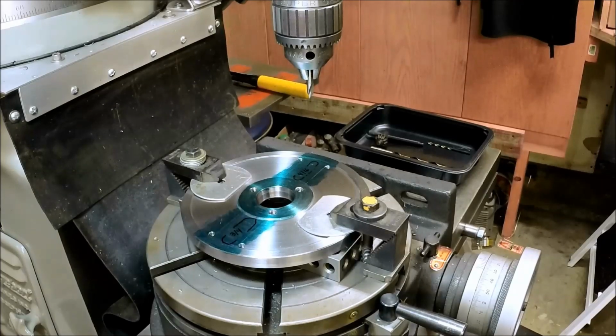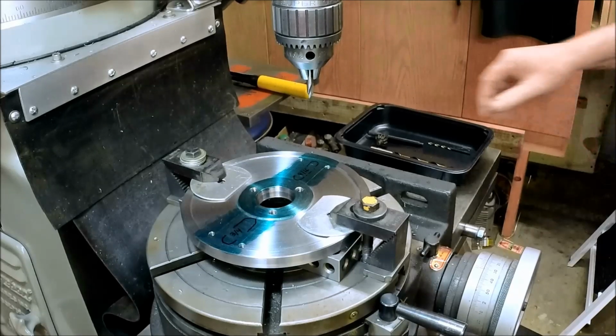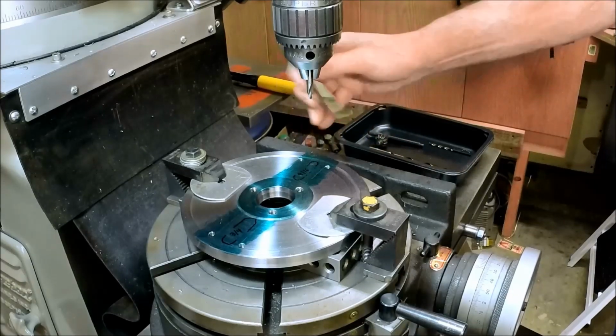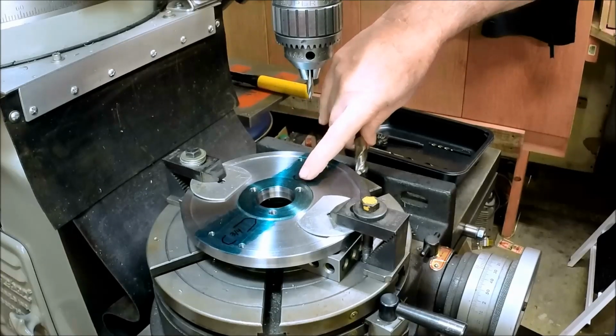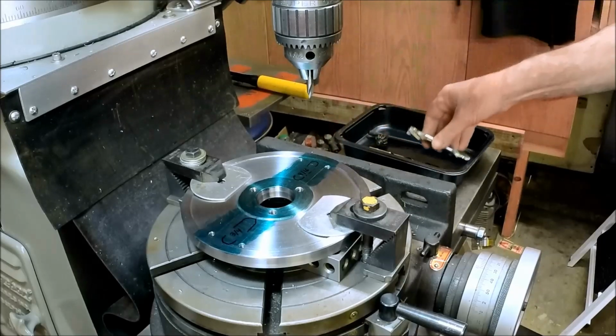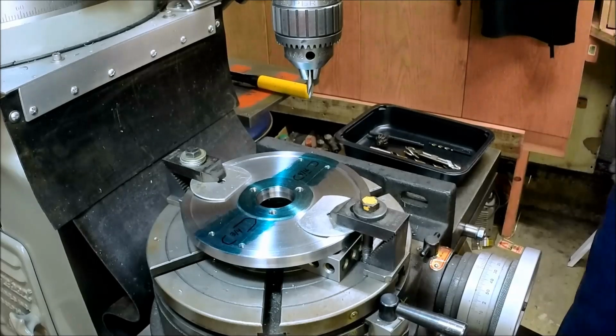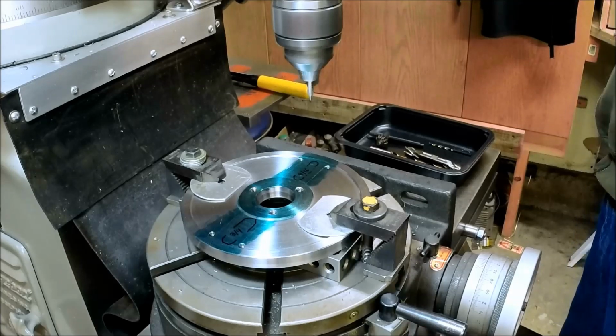We're going to drill a 1/2 inch hole at each end of our slot locations. I've got a layout line at each end. Probably can't see it on camera. And the idea is when we get toward our final dimension that we're going to leave this outer rim, and we're going to leave the inner hub. We'll get into the chamfer a little bit, but that's okay. Originally I was going to make one of these slots open all the way out, but I've tried all my lathe dogs, and so far it doesn't look like I need to do that. We can always come back later and do that if that's necessary. So, all right, let's get rolling. Once we run the right direction.